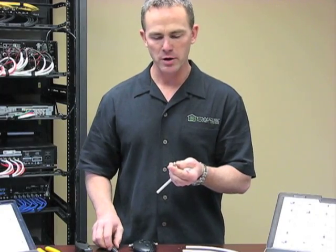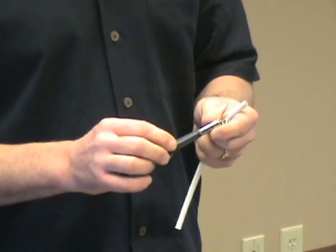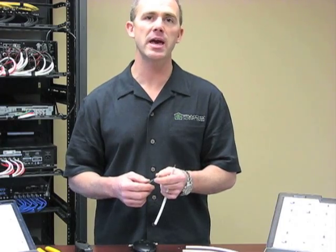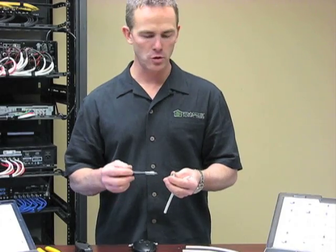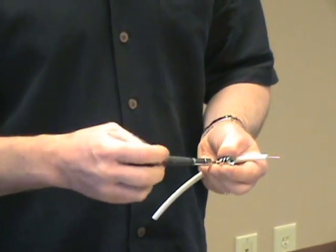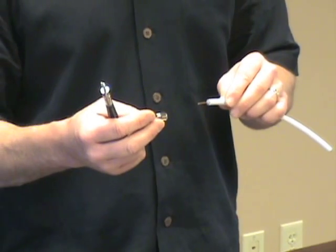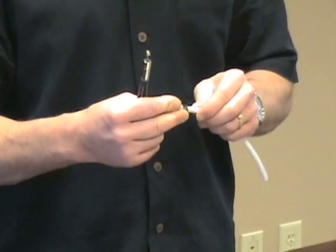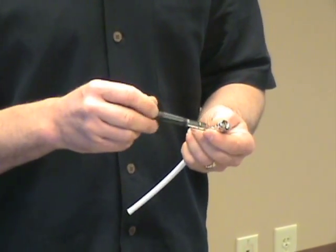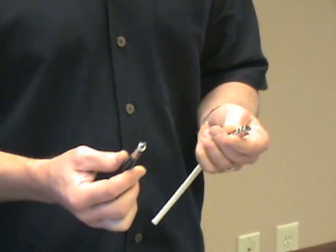I pick up one of our Universal RG6 connectors, and I have the SD-01 screwdriver here. What we've added to the screwdriver is a magnet — it helps out on making any of our other connections, be it an RCA or BNC, but it's especially helpful on the new F-Connector. Once I take the screw, I like to back it all the way out of the bore of the connector and just keep it on the screwdriver. What's unique about the F-Connector from Planet Waves is instead of trying to do all the pushing and twisting to get it on, I simply slide it onto the piece of coax cable. I insert the screw back into the connector, seat it all the way down until it stops, and that's it.